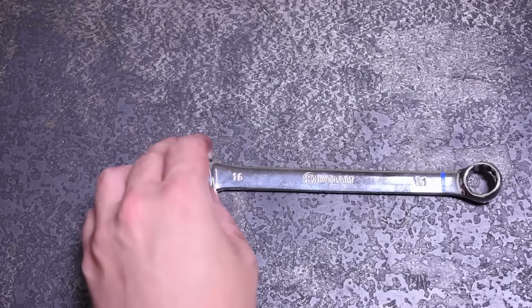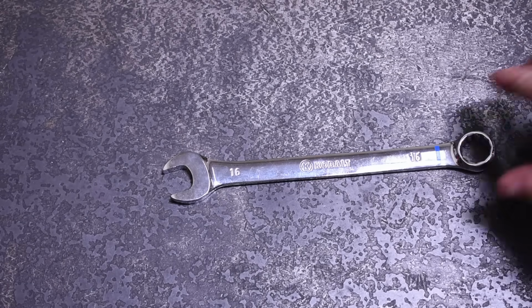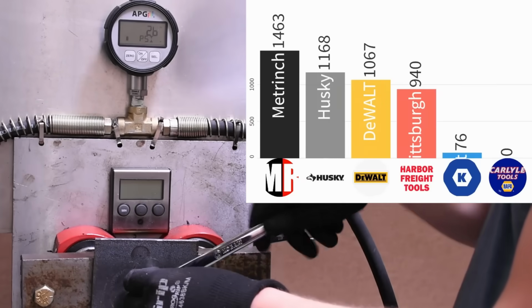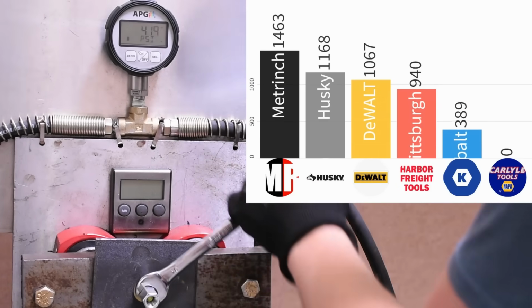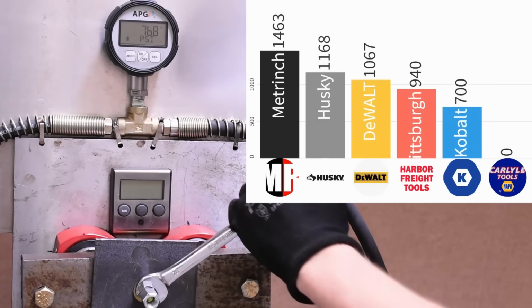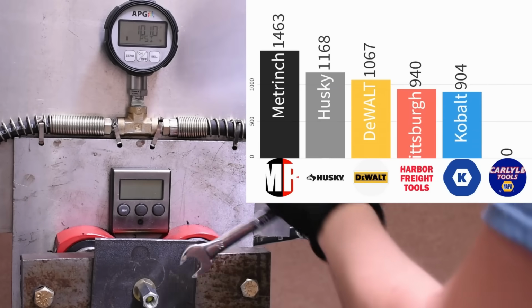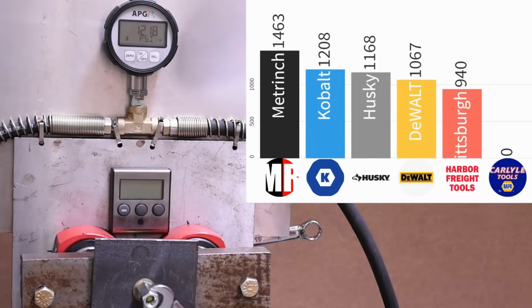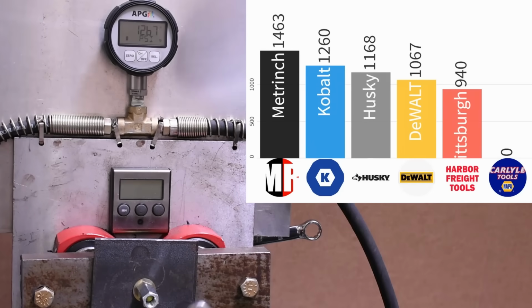Next up in price is Kobalt from Lowe's. Kobalt has always performed sort of wellish, or middle of the pack, on our channel, and its 0.18 millimeter clearance is not bad. Unlike the Husky, which is made in China, this Kobalt is from Taiwan, which is perhaps why it's giving very Tekton-like vibes in person. In use right now, it climbs to 1060, or enough for second place.